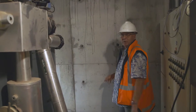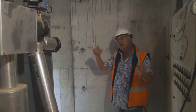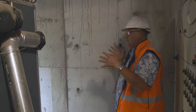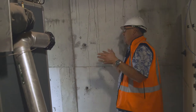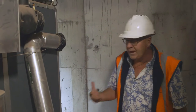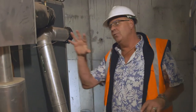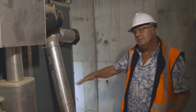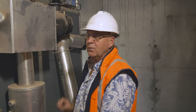We've got 80 trucks worth of concrete in this building now. The other thing we need to do — when I talk about not having connections between the northern and the southern wall — is that one of the diaphragms has to go into this space as a floor diaphragm. But as you can see, it's full of mechanical plant that is really hard to dismantle and put together again. So we thought long and hard about how we're going to do that. We're actually going to push the plant through that gap to get it out of the way, lift it, put the ply diaphragm down, and then pull it back in and drop it down again, instead of having to dismantle the whole thing.